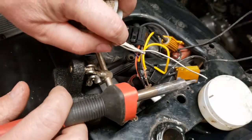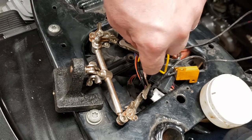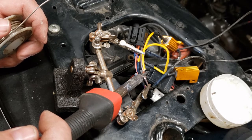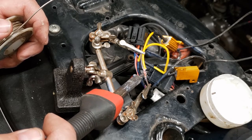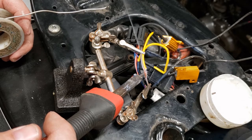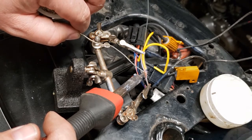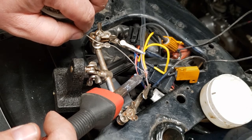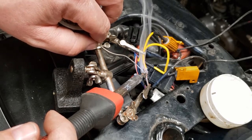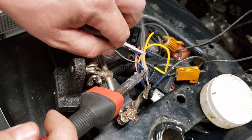I've got my soldering gun here, I've got my solder here, I've got flux on the wire. Let's just add a little bit more on there in case I've wiped it all off. Smooch it down in there. I'm going to take the soldering gun here and we're going to heat up the conductor. It should start smoking when the flux begins to melt off. As you solder this here, solder all flows into the copper conductors there — nice and smooth, doesn't bubble up on top, flows right in there. We'll put too much in because that's usually how I roll.